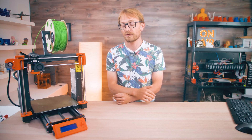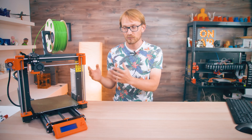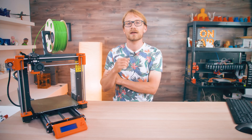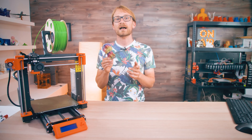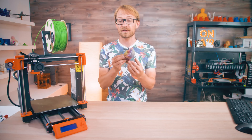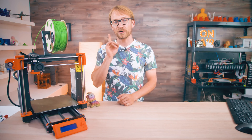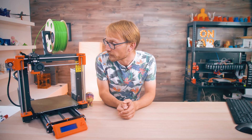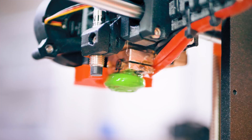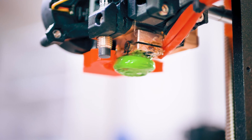Obviously, our toolset is going to be severely restricted to just the commands that a typical print would use, so if we wanted to cause harm with uploaded G-code, it leaves me with basically moving the printer around in ways that aren't super healthy for the machine. Some creative printing methods explicitly rely on G-code that is not quite standard fare. Two things come to mind: scratching the build plate and possibly bending or breaking the heatbreak by shoving the nozzle into the bed, and encasing the hotend in a blob of plastic either by extruding a whole bunch of filament in one spot or by melting the nozzle into a finished part. Both of these types of G-code exploits uploaded to PrusaPrinters without any issues.